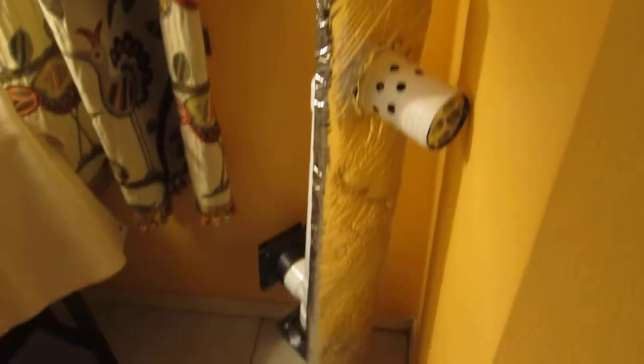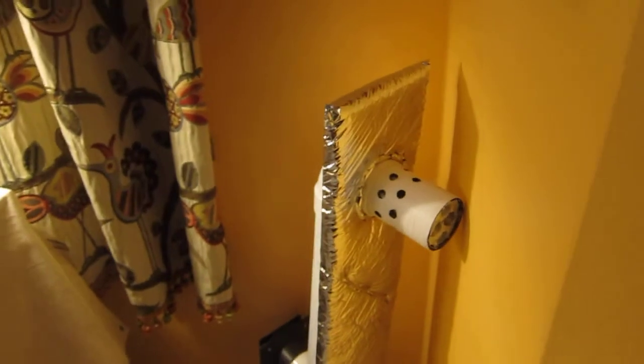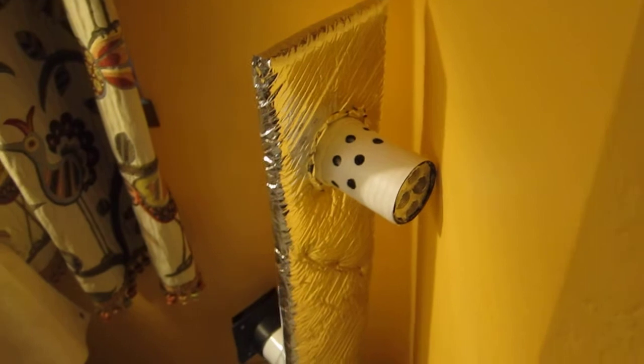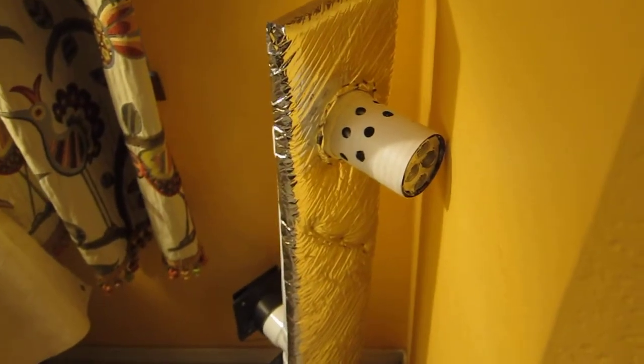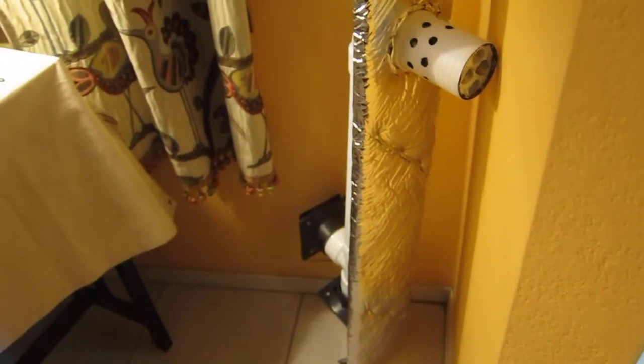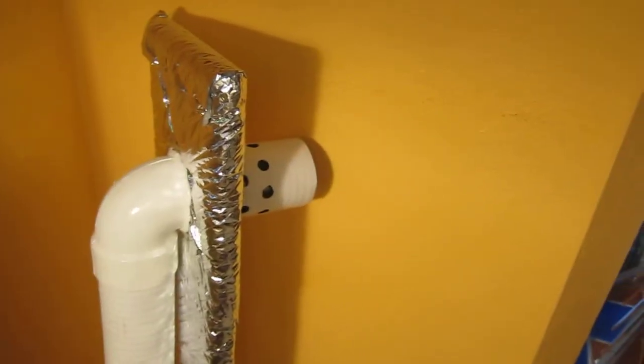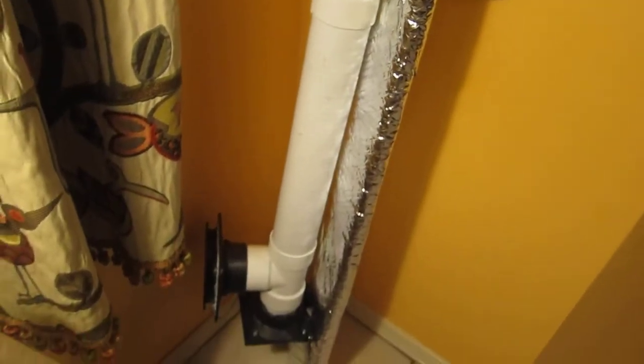My recuperator is removable. It is inserted vertically — or it can be done horizontally — into the sliding window. It consists of two parts. The first part is a board with a 3-inch hole. The board's height matches the height of the window, and it is wrapped in Reflectix and stapled to basically decrease heat exchange. The second part is the actual recuperator, which is mostly made from a 3-inch drainage pipe.